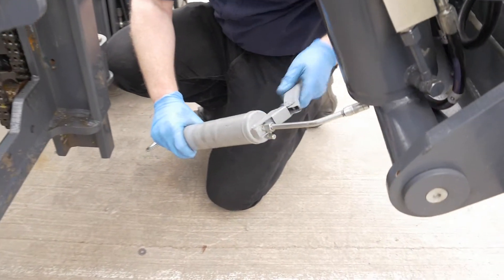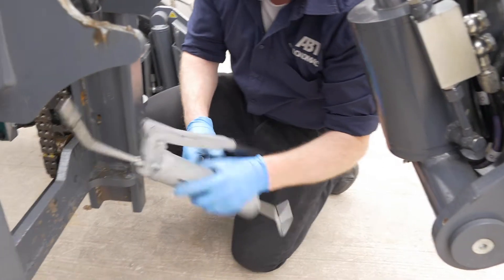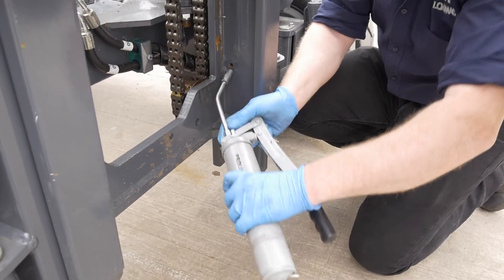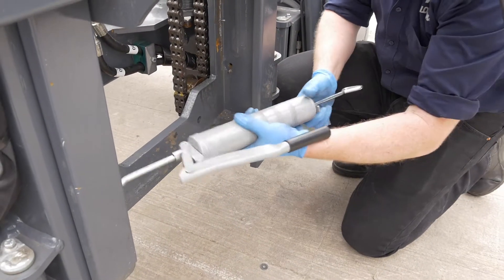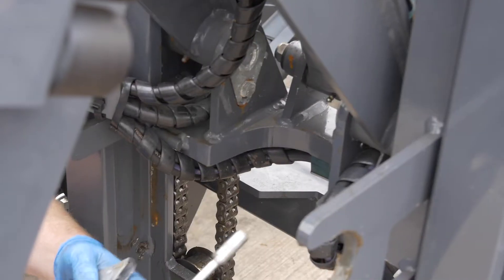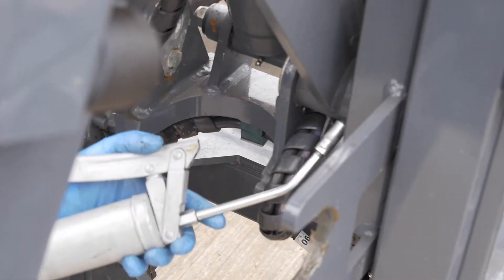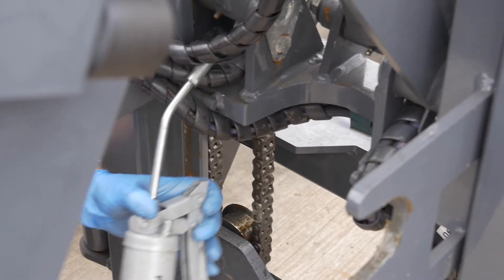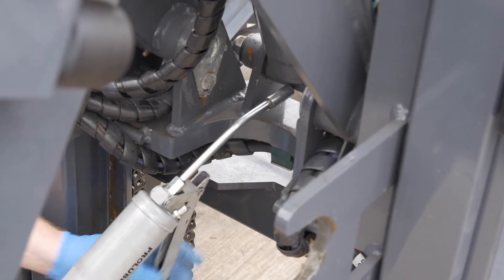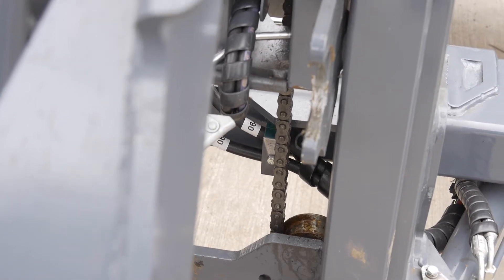Next, at the front of the mast ISR mechanism, grease the lower tilt cylinder pivot point, the main mast lower bearings, two lower ISR arm grease points, and then grease the lower ISR cylinder grease point, and on later models, the two lower third stage mast bearings.